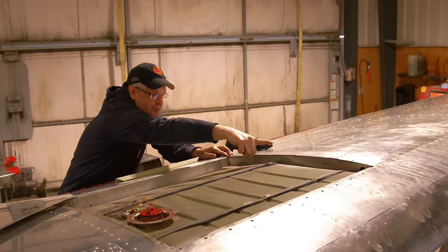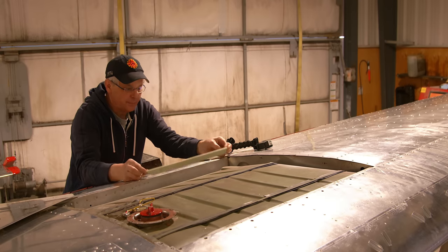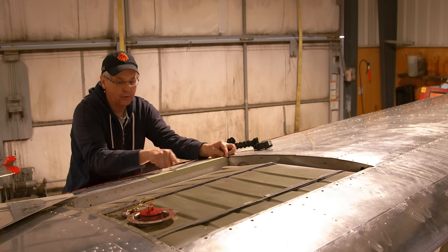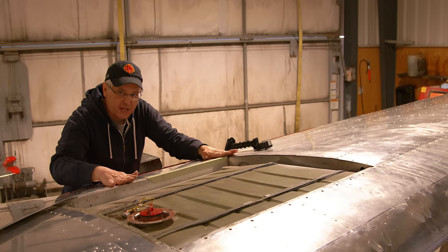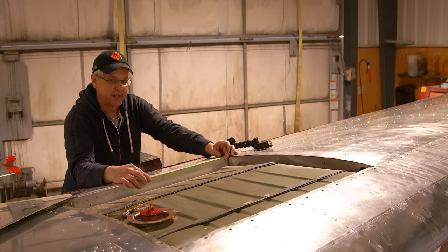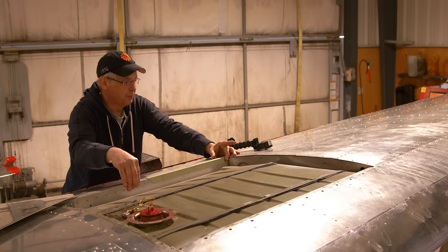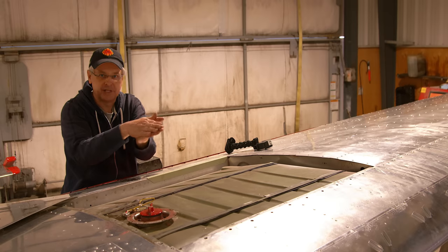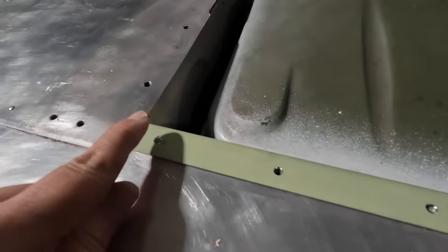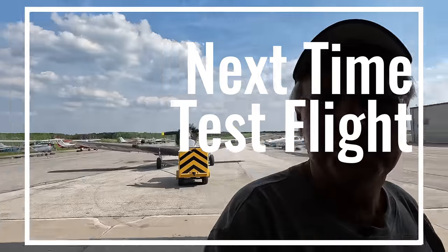The idea is that you just take out a few screws along this edge and along the trailing edge, and then you can slip this in. It comes without the holes drilled already. You slip this in, Andre marks the holes, you put the tank cover back down, and then just bolt it back in. And this gets sandwiched between the tank cover, which is structural on a Cessna 172, and the rear spar. So it just gets sandwiched together, adds that extra layer of strength. Really easy to do. We've got the tank covers off, which makes it even easier to show you what's going on here.